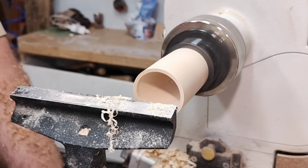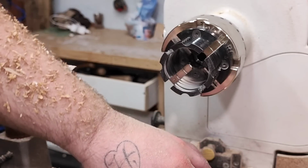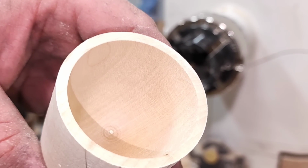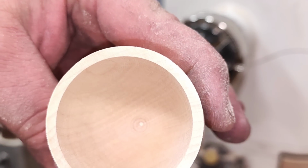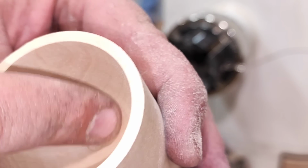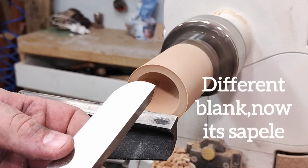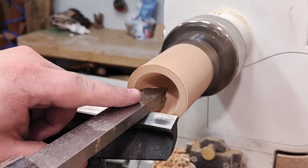Now just to show you the finish here. So hope you'll be able to see the inside of this maple is really nice. So still a little bit of a hole in the very center. But you can see it's a nice, lovely surface. In this case, I can now use, let's say, this bigger 1-inch scraper, and again, same rules apply here.